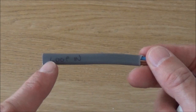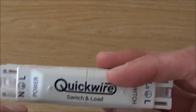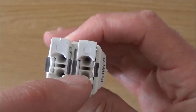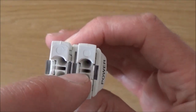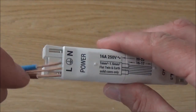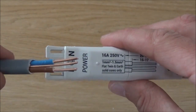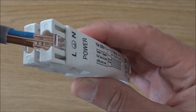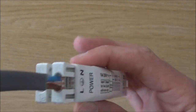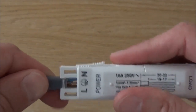I'm going to start with the loop in, which is the power coming into the light. You just need to put the loop in and the loop out into either one of the terminals marked 'power', which are on either side of the junction box. If you look inside, you can see that the entry points for the wires are slightly tapered, so they'll actually spread the wires apart for you. The only thing you have to do is make sure your cable is the right way around — your brown live cable correlates with the L and your blue neutral cable correlates with the N. Just place the cable down inside and push it in; it's very easy to locate the wires into the individual holes, and the junction box will spread the wires for you. Push the cable in until you start to feel some resistance.